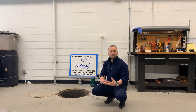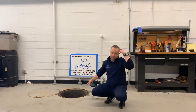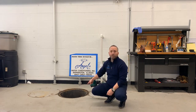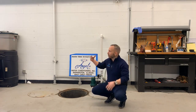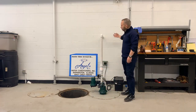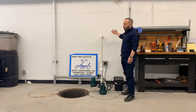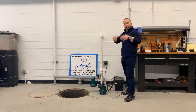I want to describe what sump pumps and battery backup systems are designed to do. Almost all homes in the Chicagoland area that have a basement — I'd say 99% — have a sump pump or sump pit. The purpose of the sump pit is to gather the water that surrounds the home. If this concrete wall in the back were in a basement, the water surrounding the house always wants to come inward towards the hole in the ground, which is your basement.